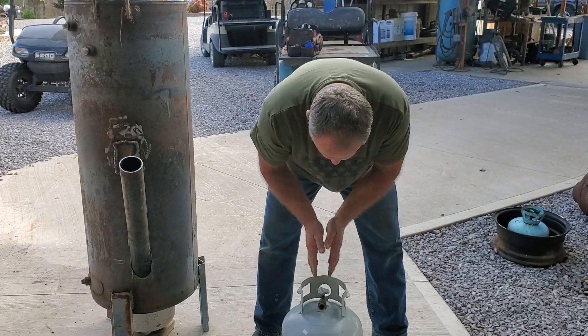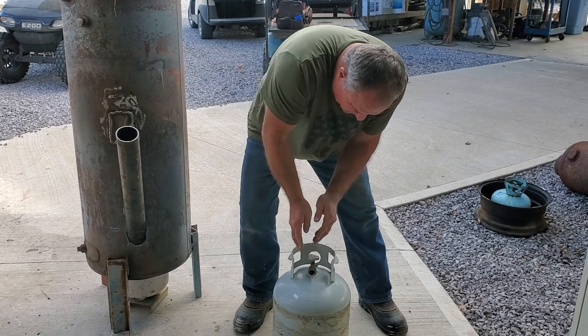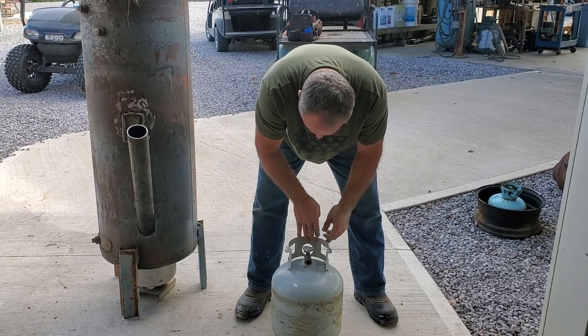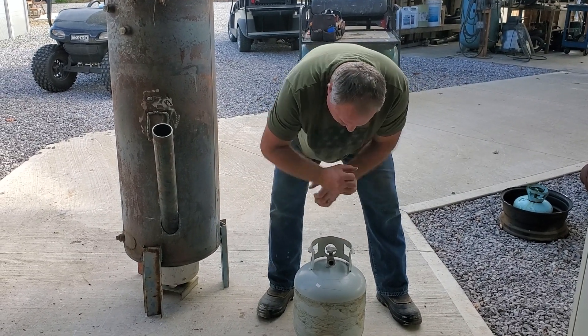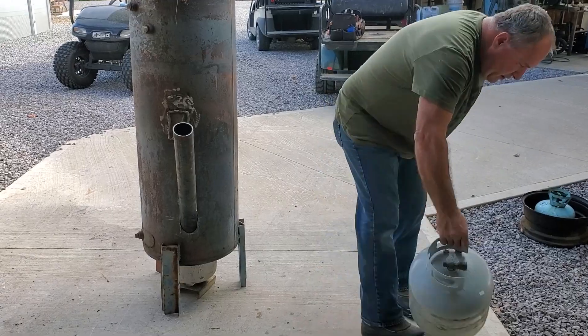This tank is what I start out with — an old propane tank, you can get these anywhere. I take the valve out, which leaves a three-quarter inch hole — that's where I put my drain. I turn this over when I use it and the bottom ends up getting cut out. I've got a pipe that slides over this so I can turn it, then I put something in there to keep it from turning in my vise, use my pipe wrench, and take this valve out.